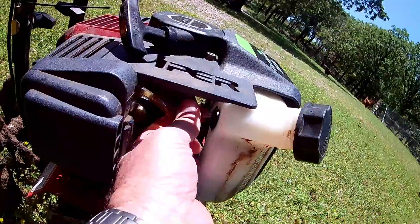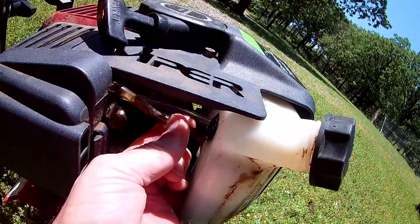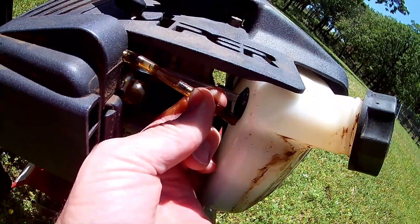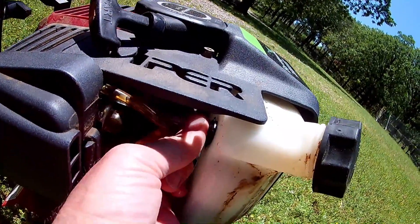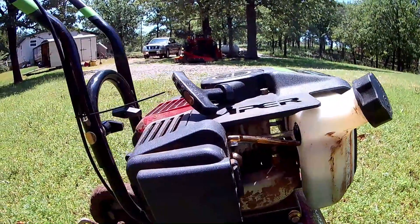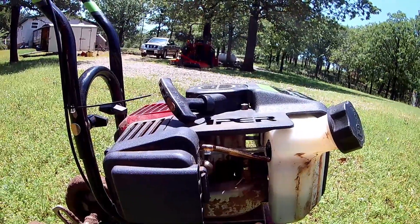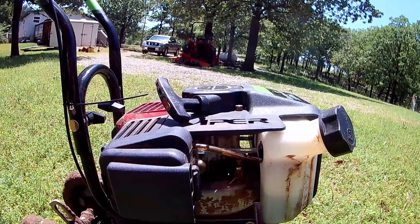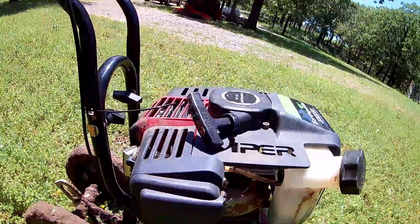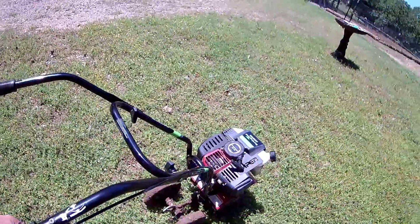Here's the grommet and the hose. The return line going back into the tank is just chewed away — you can see it. The grommet has shrunk and it doesn't fit properly, so the fuel runs out. Hopefully I'll have that repaired soon. As you can see, there's quite a bit of weeding to do in the potato bed. I'm an old man — I could do it by hand, but I prefer to use this because it still leaves a lot of hand work. Otherwise, it's been a good machine.